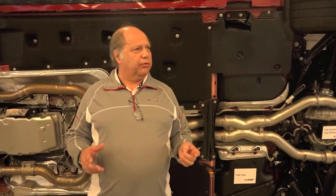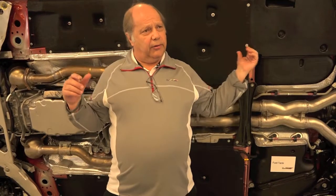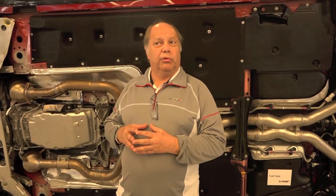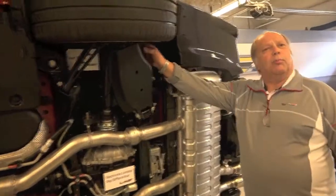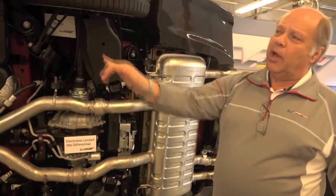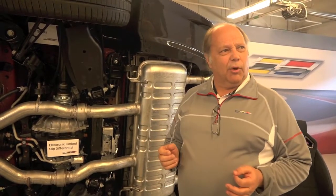With some enhanced braces to the rear suspension and structural adhesive in the rear of the car, we've been able to increase the torsional stiffness of the vehicle by between 25 and 30 percent — which is significant because it allows the suspension to work efficiently. The suspension system has been completely retuned. The McPherson strut and multi-link rear suspensions have a total of 10 all-new bushings or mounts and six that have been retuned. The toe links now use ball joints substituted for bushings at either end, and any bushings previously on center have also been changed to ball joints, removing compliance and giving great on-center feel.